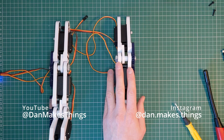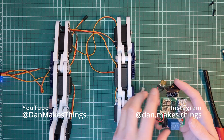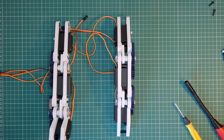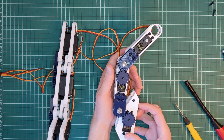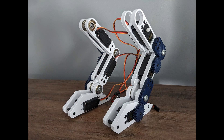The next step is to take the body electronics — the PCB, batteries, and power delivery board — and create a body framework. As part of that I'll create a stronger section that cradles the body, and the legs can attach to it. I'm not planning to support walking in this version, but I have planned space for lateral movement in future which could facilitate this. The new leg mechanism is a combination of various design elements — herringbone gears, bearings, and 3D printed components — offering stability and ease of assembly with a good range of motion. The files for this project are available online, links in the description. Stay tuned for more updates as I move forward creating the body and neck, as well as the latest version of the software using ROS2 on the Raspberry Pi. Thanks for watching.